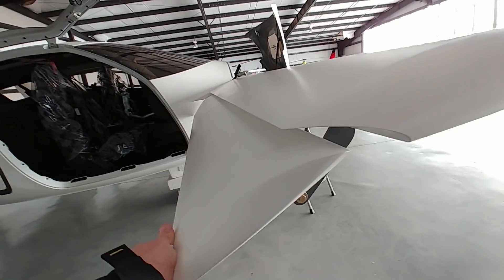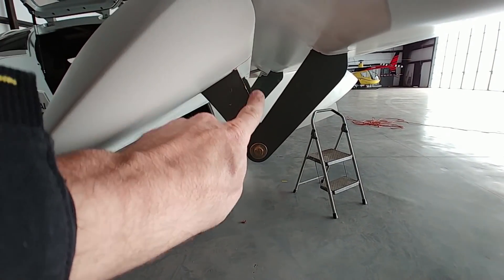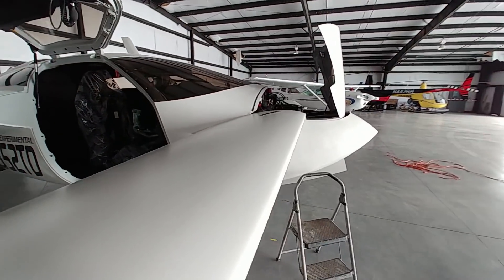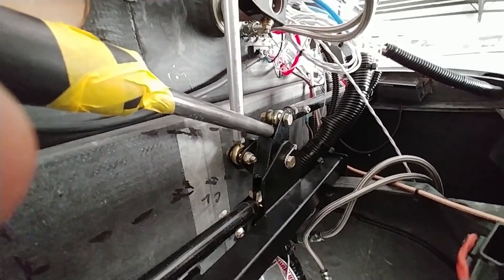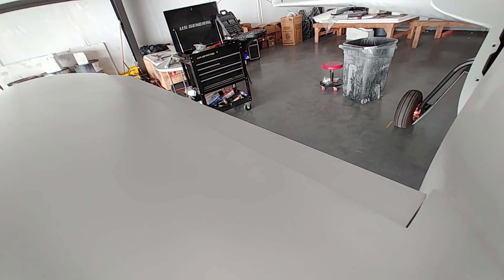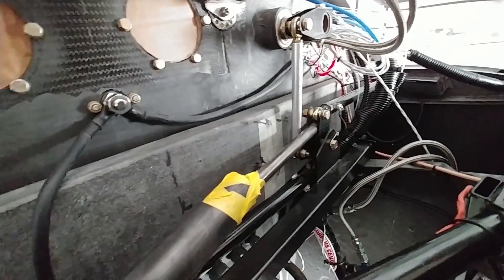One of the other things on Mark's must-do-before-first-flight list was to have this elevator dynamically mass balanced. As you can see, the complete elevator sits aft of the hinge point when fully deflected, meaning all the weight wants to pull it down. I need to put some weight on there to balance it back — same as what I did on the ailerons. I don't want to do it from the outside because that would look ugly, but you can do it from the inside. A mock-up shows how it works: a pivot arm with some weight basically adds mass to balance it out.